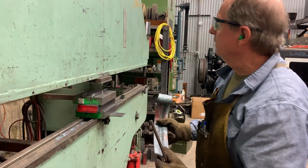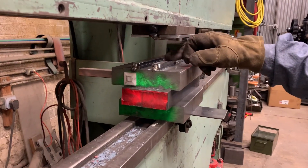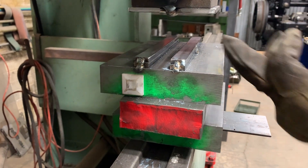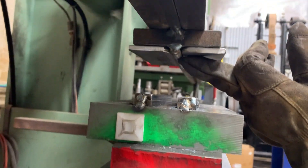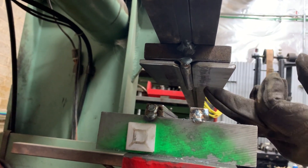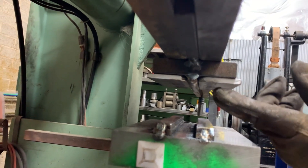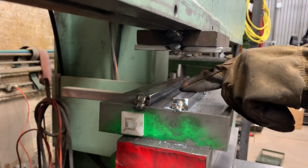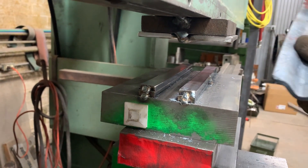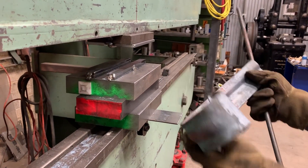What I did is I blocked up using some heavy bar plate. I welded two parallel bars such that when I drop down with my top punch, I have a piece of ½ inch tubing welded in and two ¼ inch blocks on both sides, so that these blocks will hit at the end of the stroke and I can go ahead and produce that shape. I did that first and then I made the scroll.